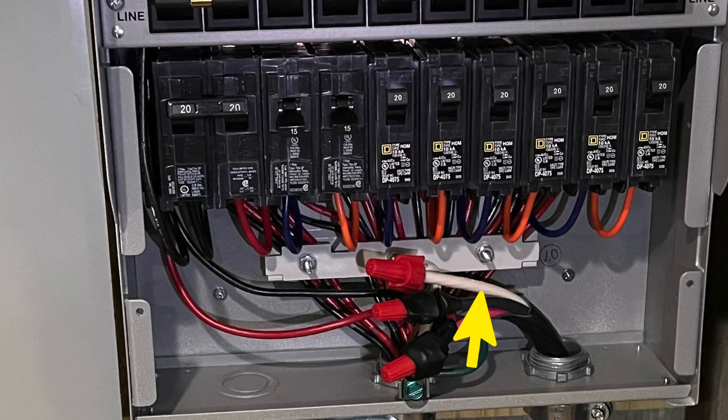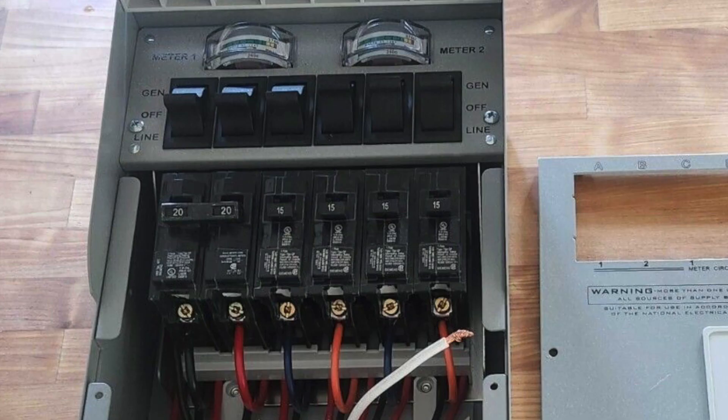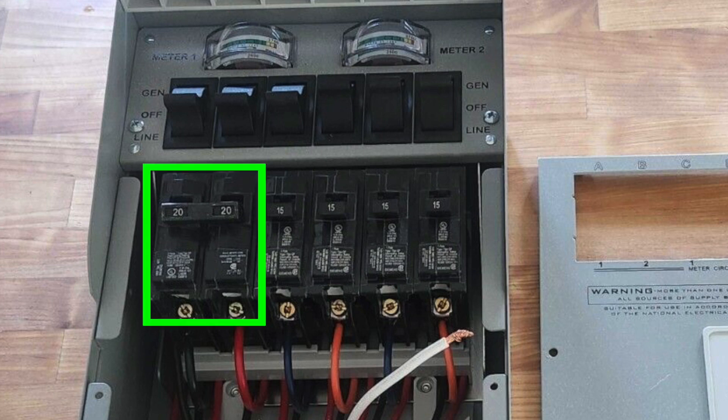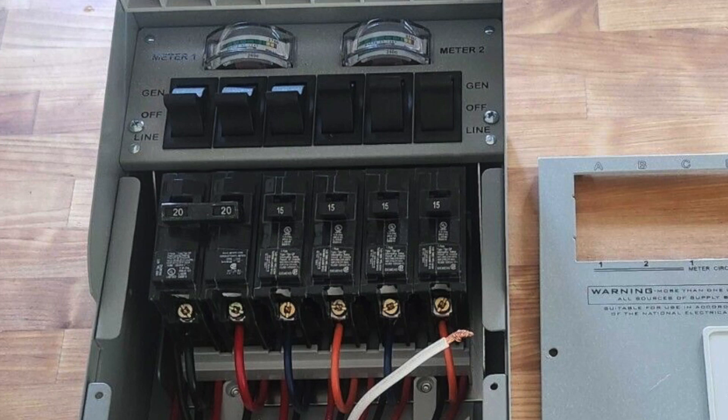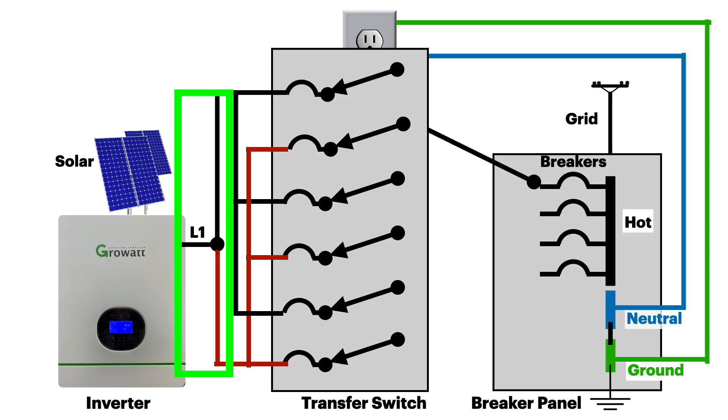We'll come back to this white wire in a second. If you're running split phase 240 volts, you can use a double breaker to run a 240-volt circuit — it takes up two slots, A and B. At least some, if not all, of the Reliance transfer switches come with the first two slots filled with a double breaker. The switches up here are tied together with a removable tie. If you want to use separate circuits, just pop in separate circuit breakers and remove the tie on the switches. You can also wire up this transfer switch to work with a single-phase inverter — one that only has 120 volts and only carries a hot line or line one. Just connect that line one to both the black and the red in the transfer switch, so you have three wires — the hot from the inverter and the black and red in the transfer switch — all attached together with a wire nut.